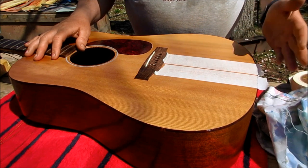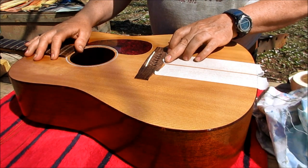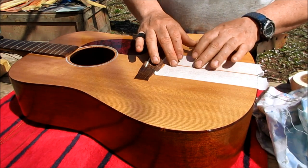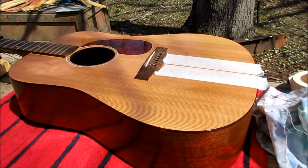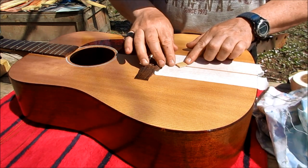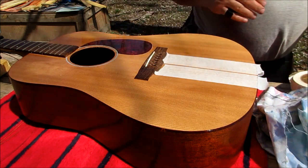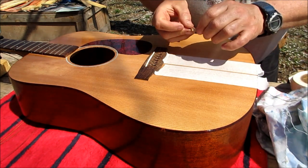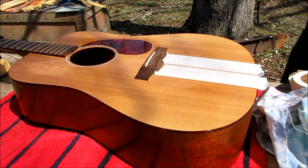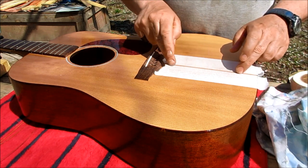And it goes through a lot of swings. I got it a year or so ago, and the top was split wide open. So I put some wood cleats, which are nothing more basically than triangles of wood that you glue like that with the grain running diagonal. Or I guess you could probably do it like that too, with the grain running across. And I glued them to the underside of the top here, here, and here.